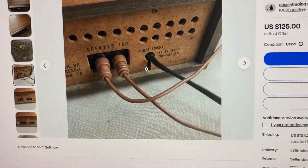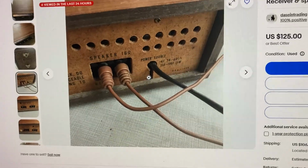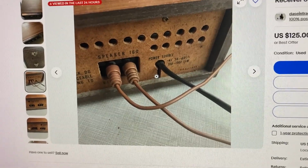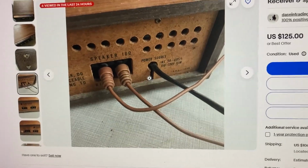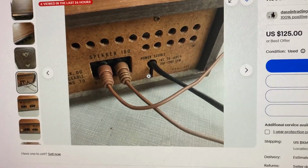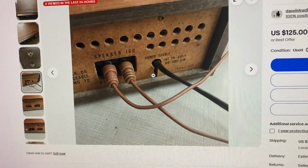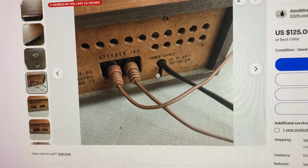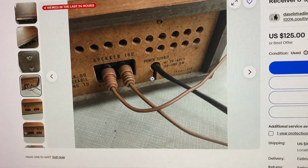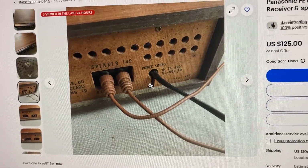All right, so we're gonna just for a little bit, hook up an 8 ohm speaker for it. Now, if you got a 16 ohm, I've heard you can go like 12 ohm and you'll be all right. Or you could go 20 ohm and you'll be all right, if they even make a 20 ohm. Like if you go a little bit off, you're okay, like 1 step. But if you go 2 steps, where it's getting half the impedance that it wants, it's not going to be all that happy with that. But we can use it to test it.